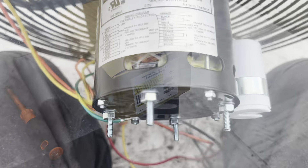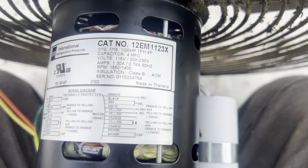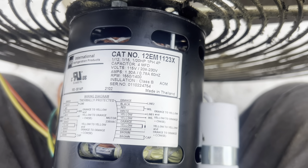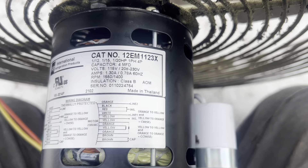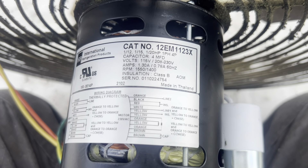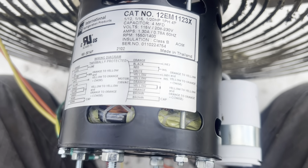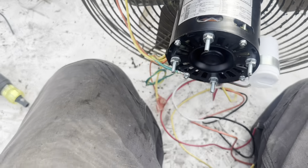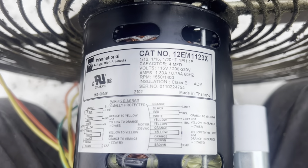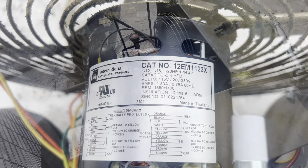Just to be clear: when you push this, you get 208 to 240 volts to the fan, and the fan doesn't go. I did this with two hands to check — because if you have a bad capacitor, the fan won't go. But look at how it doesn't spin at all. You should be able to hit it and it spins freely. Fan change.